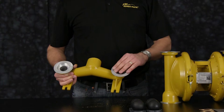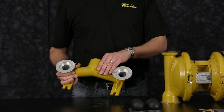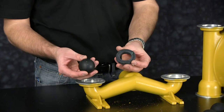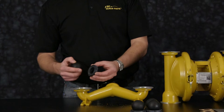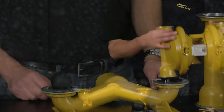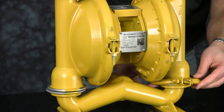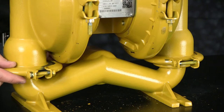Now we're ready to install our suction manifold. Inspect the integrity of the casting. Now we're ready to install our valve seat and check ball. The o-ring is built into the check valve seat. The flat surface goes towards the check ball and the o-ring faces down. Repeat this process for the opposite valve seat. Now install our center section over top of the suction manifold. Begin to install our clamp band assemblies — be sure to fully seat the clamp band assembly around the outer chamber and suction manifold. There is no torque spec for the clamp bands themselves, but tighten them evenly.